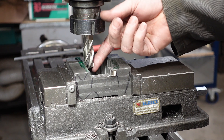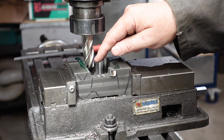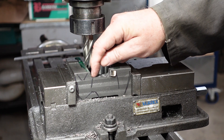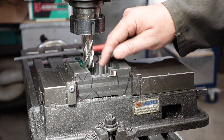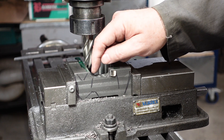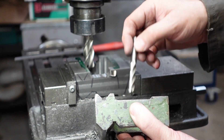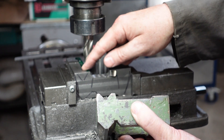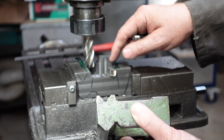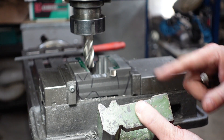I've just done a pass through here with the cutter that I put a radius on in my sharpening video, and as you can see it's left a nice little fillet in there. The reason I like doing it this way is that if I use a ball-nose cutter I've got to get the flat-ended cutter to precisely line up and be tangent to that radius, whereas here it's built in and I can do passes back and forth. I lose a little bit on the outer edges but I get a nice continuous finish. The reason I'm doing this is that I've got to come in with a tapered cutter and run around this inside pocket — the lower I can get that fillet the better off I am. Once that's sorted I can start thinking about the V's and the corresponding flats.